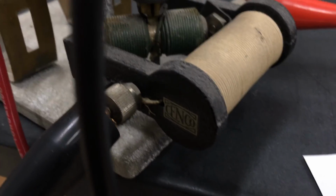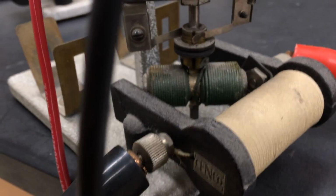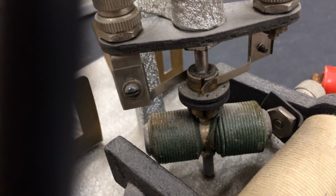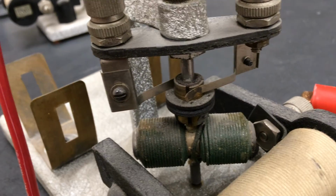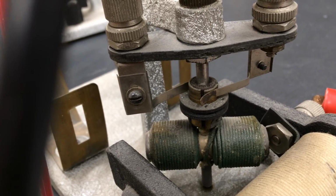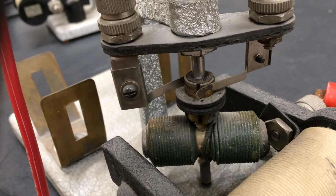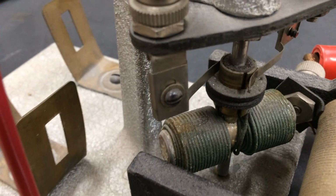So in this system, that tan coil wire serves as an electromagnet, and the force is put on this rotating green wire. And if you look at what hooks the electricity up to the green wire, it's these pieces of metal that come out and brush the rotating thing. They're called brushes. If you look, they're touching a very interesting thing that spins. It's broken in the middle.